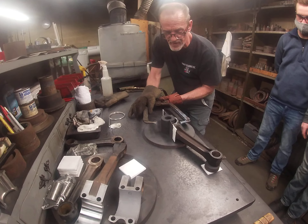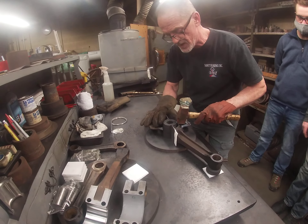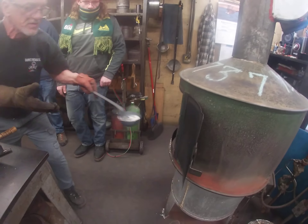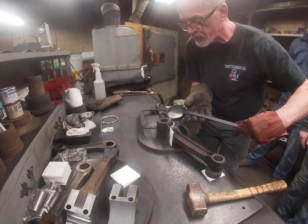See, because the metal expands and contracts — nice and flat. Now we're going to take the babbitt. This babbitt is 800 degrees — way too hot. And this becomes the white metal that's in there. So now we're going to pour the shell.